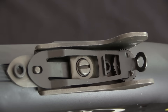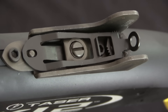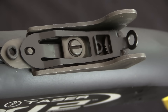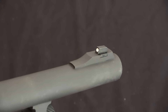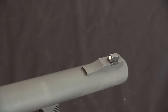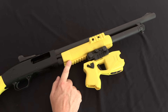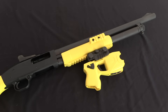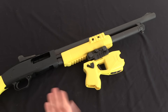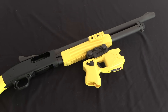They gave the gun a unique set of sights as well — a really big ghost ring sight, optimised for shooting within about 30 yards, which is the effective range of the Taser projectile. The front sight is a front post with a high-visibility white dot. As far as the magazine goes, the Taser shells work just like regular shotgun shells — you can load a magazine of them and they cycle and feed through the extractor. You could load up a tube with five of them at once and have five shots at your disposal.